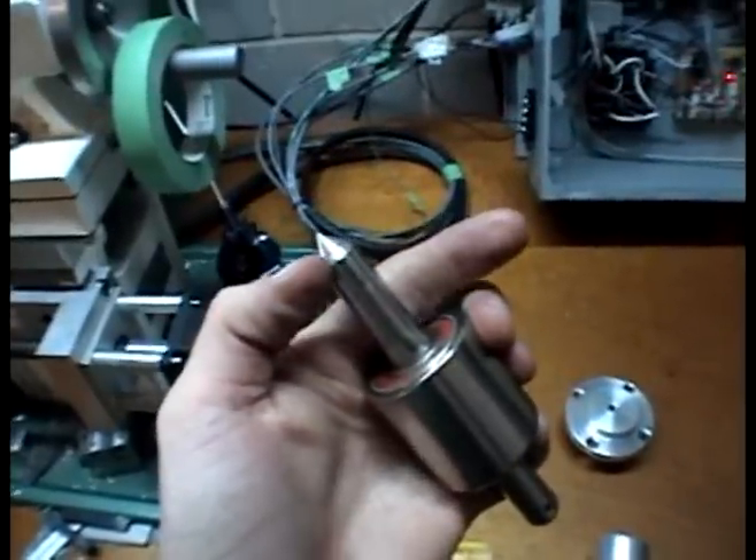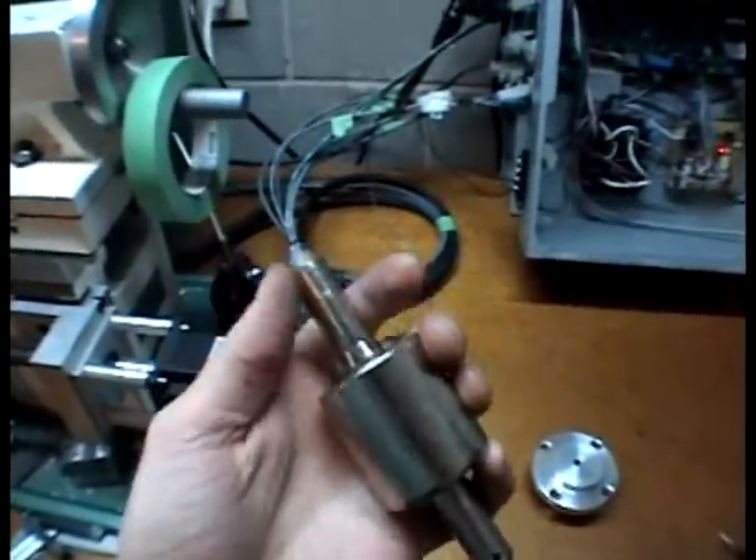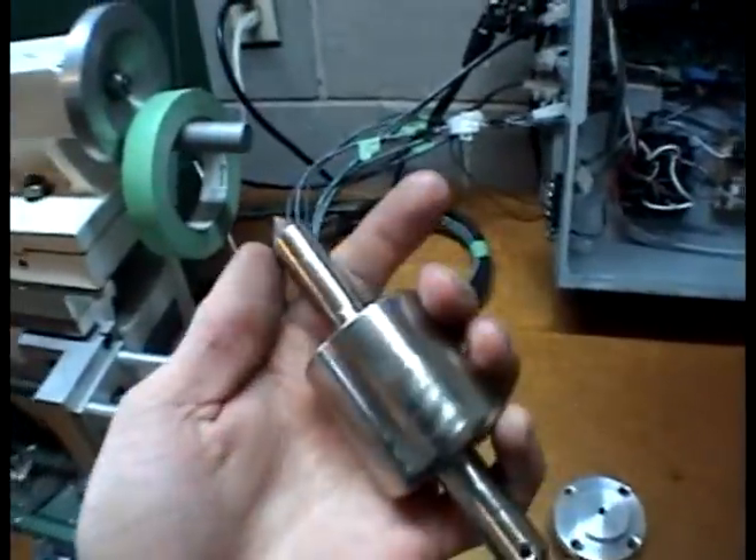So then I made one out of steel. I made a steel pin and I hardened it with my oxyacetylene torch — just heat it red hot, dunk it in water. Good to go.